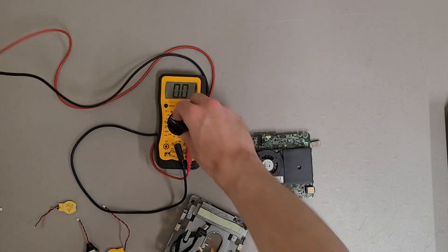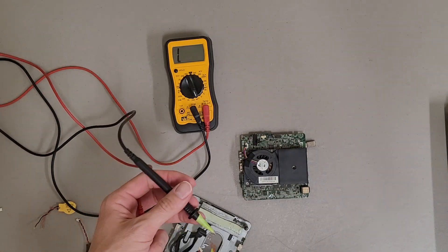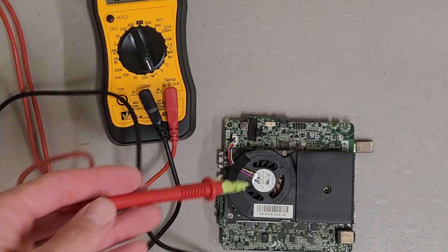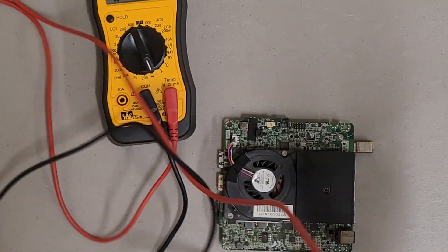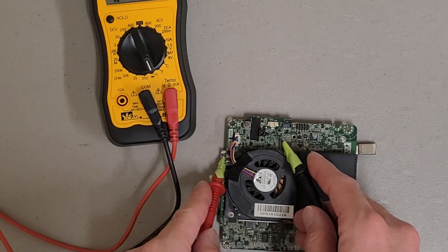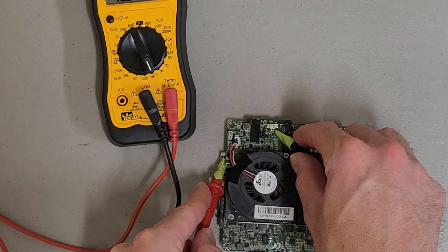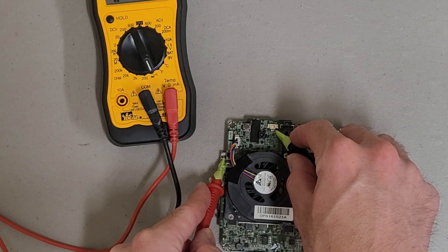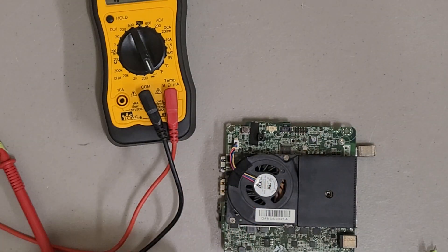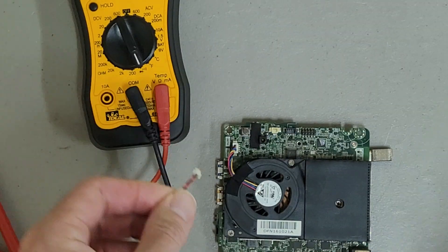One thing you can do to verify that, if you're having weird issues like this — it's going to be kind of hard to do on camera, I'll zoom in some more. Generally, negative on a battery or negative on anything goes to ground, and a good grounding point is like the shell of a USB port. From there, you can poke at the pins — I'm going to do it on the PCB because I can see it better — and you can figure out which one's the negative and which one's the positive. In this case, it's the right side of your screen for the connector itself, which in positioning coincides with how the original battery plugged in.